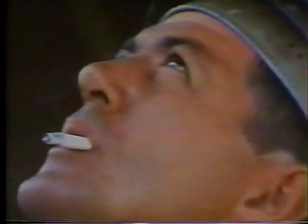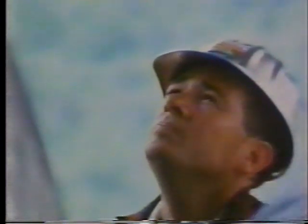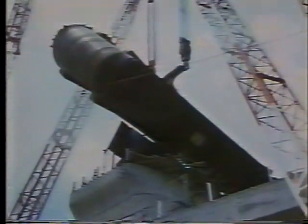The first points of contact are 4 tapered dowels engaging the hub bolt holes to index the piece while lowering. The dowels enter, so the indexing is satisfactory and lowering continues. But the face-to-face angle, so carefully planned, is off by several degrees. It is decided to risk hanging up on the 10-foot diameter entering spigot. The male and female are size for size. Lowering continues, and it hangs up about half entered.